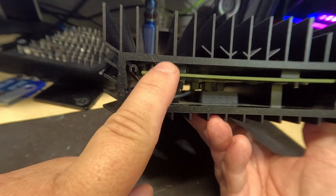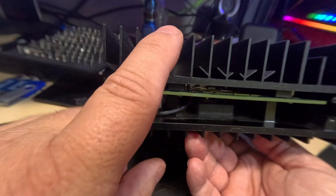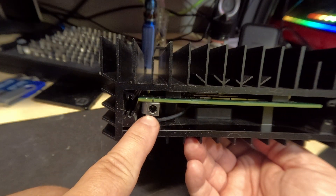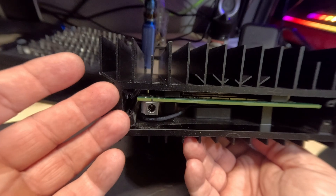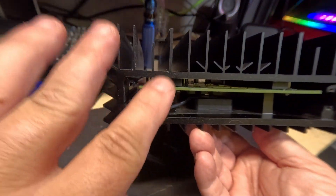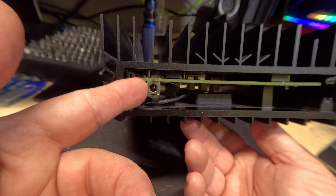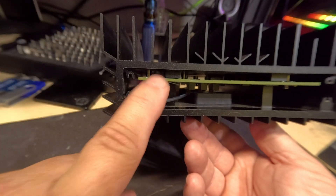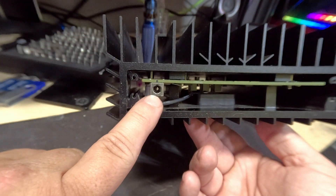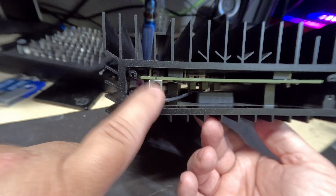What happened is way more than 10 amps went through it. These barrel jacks are only rated for 10 amps maximum. He had this overclocked — either the 280 gigahash or maybe even the 320 gigahash — and was running it at 12 volts. That's why there was so much amperage through this plug. It doesn't matter that he was using a veteran miner 12-volt-to-barrel-jack adapter; that part wasn't the problem. The problem is these barrel jack connectors are only rated for up to 10 amps, and you really shouldn't run them over 8 amps — that 80% rule applies to connectors too. He was actually testing to see what would happen long term. You can run 12 volts and over-ampere like 15 amps, which is what he was running. It lasted longer than we expected, but it's not an if — it's a when. It's going to fail.